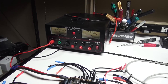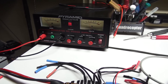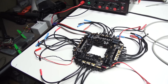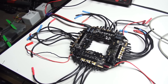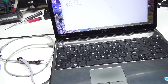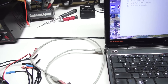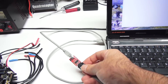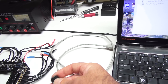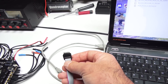The tools we're going to be using are our power supply, set to 12 volts out, our BL boards — this is the Double Quadro, the cool version — our laptop, MK Tools, the latest version of the BL firmware, our MK USB, and a special connector we made up. We took two pins out, so it's effectively eight pins.